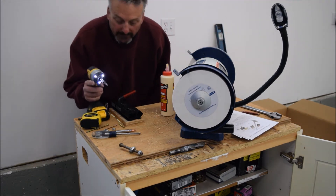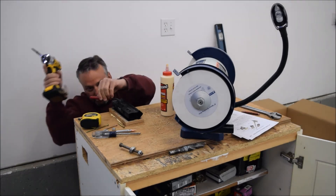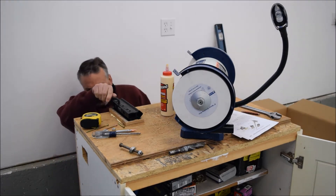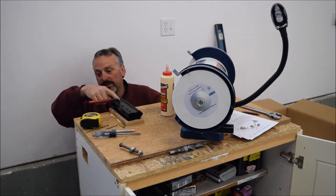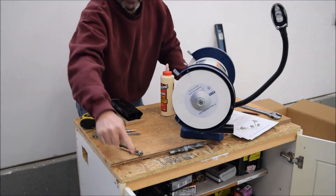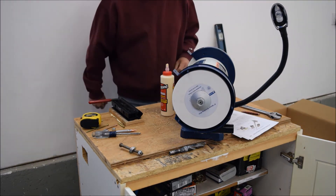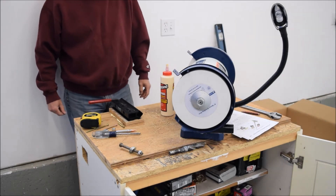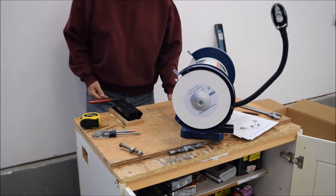There we go. You can see these are now awesome — nice and screwed down, tight and ready to go. I have two-and-a-half inch screws down, so basically the top of this cabinet and this board are now fused as one. So if I ever move it, I'll just take the top of this cabinet off — it's just OSB — and put another top on the cabinet. It'll be awesome. A little glue just for the sake of glue.